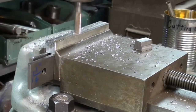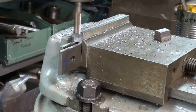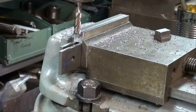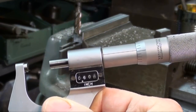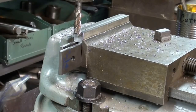Through the magic of television, this will be the end of the pass. I'm going to turn the machine off, and I already slid the parallels down so I can get the micrometer on the other end. Be sure and wear safety glasses when you do any operation like this — I have mine on. Remove the chips with a brush, and now I'll use the micrometer on the far end. A micrometer works better than a caliper for that, and I am right on six hundred thousandths. So this is a very valid method of finding the location of your work — just by coming up and touching it and deducting a thousandth. I'm down to dimension on one side; now I'll do the other.